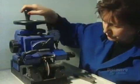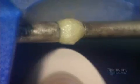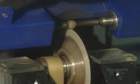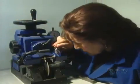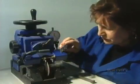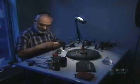They must saw the diamond in the direction of its grain. Then, using hot glue, secure the rough diamond into a holder positioned over the saw. The saw has a very fine bronze blade, but it can't cut through the diamond on its own. Only diamond can cut diamond, so they coat the blade in a mixture of diamond dust and oil. Sawing an average-size rough diamond in two can take up to 4 hours.